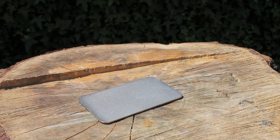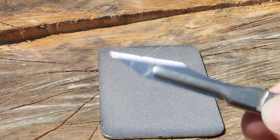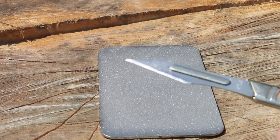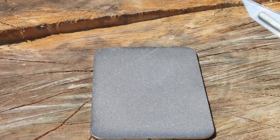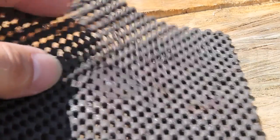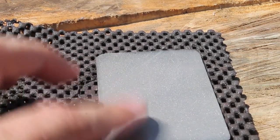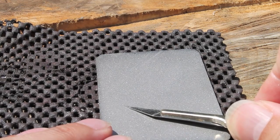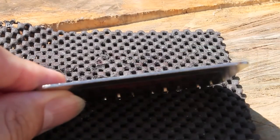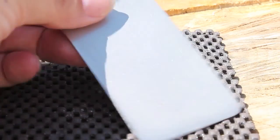So how do you use a knife sharpener? I've just got a little craft knife here — a little scalpel — and I'm going to show you the basic technique. You want to put your sharpening stone flat on a flat surface. I find this rubber sheeting really useful — you get it in car shops for your dashboard or toolboxes. Make sure your sharpening stone is nice and flat and firmly fixed. Your blade wants to be at about 20 degrees — a very shallow angle.